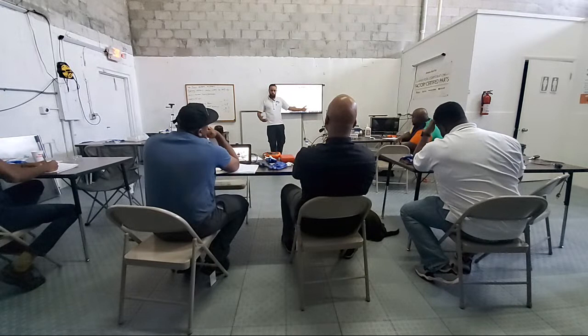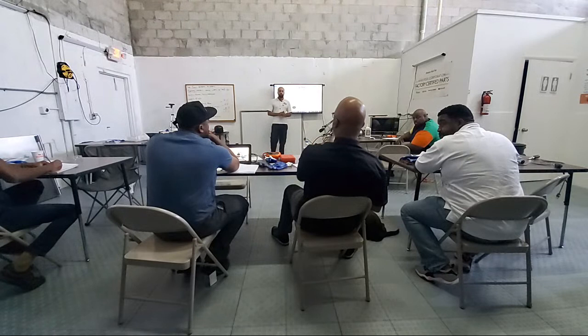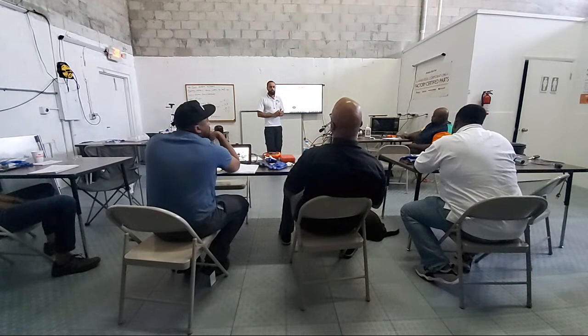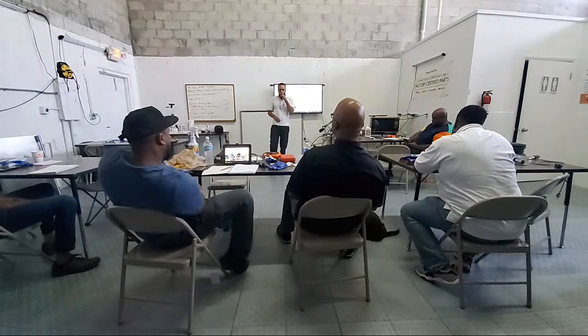Yeah, because when I felt that one pressure, I was expecting a lot more when we cut it over here. I was thinking a lot more force. Especially coming out of the cap, it's going to be smaller. So, could it be like a partial restriction? No, you'll always feel it a little less than the drier, but you still feel it coming out.